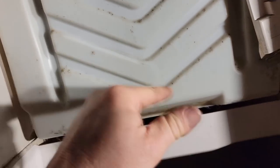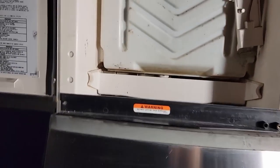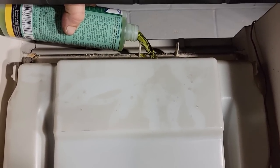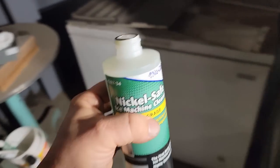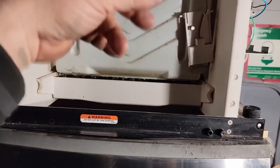Let's get all this lovely black crap out of here. There's really no good place to rinse anything here because it's a factory — a very dirty factory. We'll have to do it in the bathroom in a sink, unfortunately. It's not the most hygienic place in the world, but it's better than what it looks like now. Normally they use three ounces of cleaner, but most of the time they're anticipating people actually take care of the machine before it breaks. We're running half a bottle, which is about eight ounces. That'll just barely get it done. We'll use the remainder in the pan to scrub the last remaining stuff out.